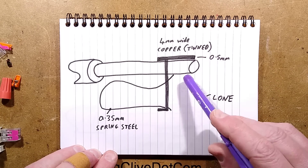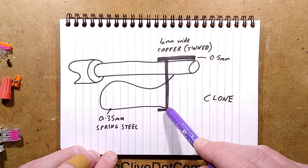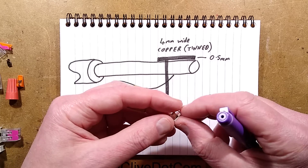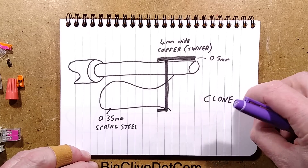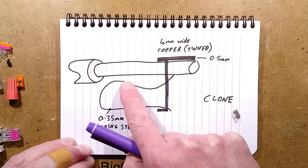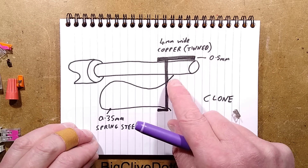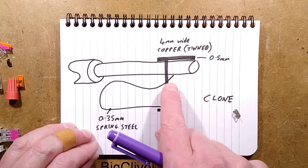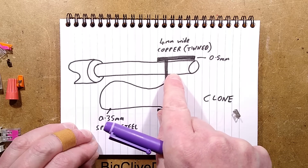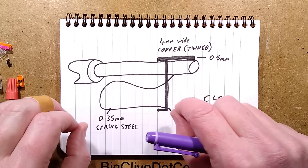Here is the clone. It has a little copper plate, and the spring is actually hooked underneath at this end where it comes down. Here's the little plate — it's very, very tiny. When you pull the lever over, it impinges down and pushes the spring down. You put the wire in, and when you release it, it pushes the wire up against this copper plate — roughly central — but it also bites into the copper a little bit, so if you try to pull the wire out it acts as a degree of strain relief, purely to grip it and stop it popping out accidentally.